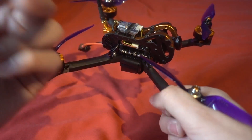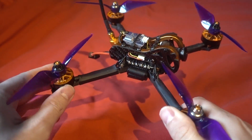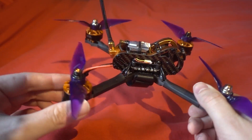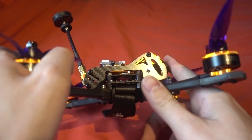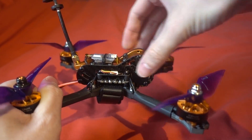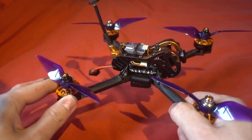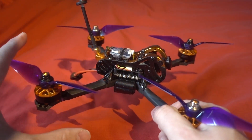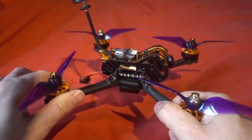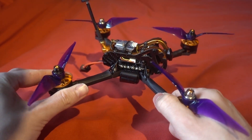There's no smart audio on the VTX, which is fine — you can access the VTX on the top, no problem. One thing I did like is that you have some soft mount standoffs here, so there weren't any problems with mid-throttle oscillations or noise reaching through to the flight controller. In general it did fly pretty nicely. The camera also isn't protected up front despite all of the aluminium up there. Anytime you start switching out components to fix things, you are eating into that $100 budget — you might as well pick the components yourself and spend a little more for better quality. I would leave this as it is, maybe put on a wide-angle lens and class it as a basher quad.